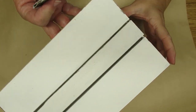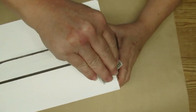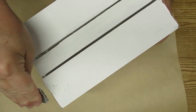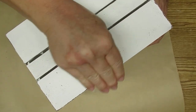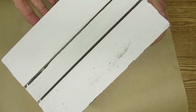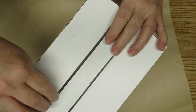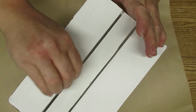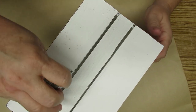The two coats are dry now and this is where I can do my distressing. I'm using some really rough grit sandpaper because I don't want to have to sand till my arm falls off. This is just an easy way to pull off quite a bit of paint very easily, and I want that brown to show through so that's why I'm doing it fairly rough. It's making it look pretty chippy and that's the look I'm going for. The only tricky part was getting in between the grooves — I had to wedge the sandpaper in between and just run it across.